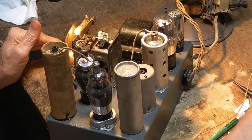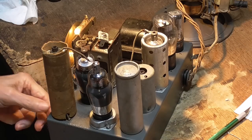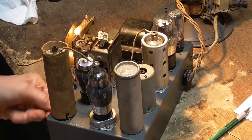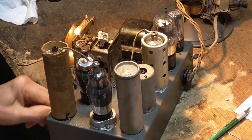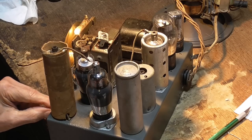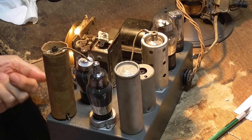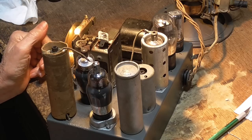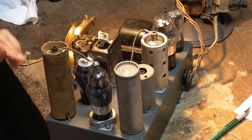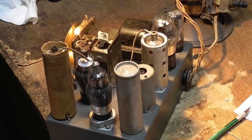I'm going to go ahead and connect the generator. I have no idea what position, if any, this switch is in. I think the switch has got one of its stops broken off. One of them is still there, but it should only be a two-position switch, and you can turn it 180 degrees. It's too much. So I think the other stop is broken off. So I'll have to figure out where that should be. Okay, we'll need scope. Let's get scope.